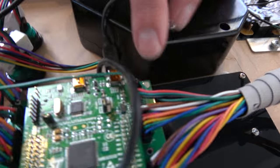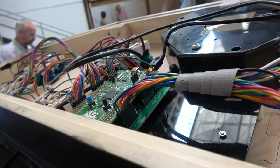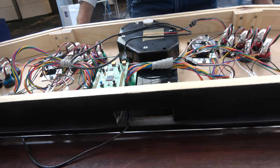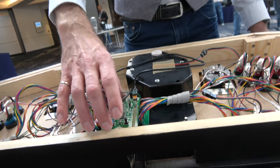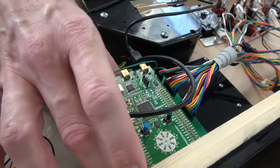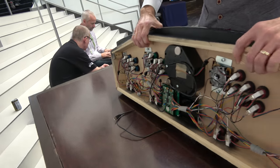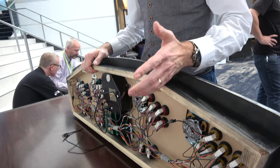There's one channel — this cable right here — that drives all of the pixels in the string. The STM32 is connected over USB. I wrote firmware to expose it as a USB HID device. So when you plug this into the 96 board or a laptop, it shows up as four joysticks and a mouse. When I have the firmware finished, there will also be an interface for controlling the colors of the LEDs.